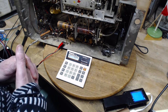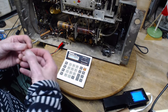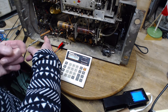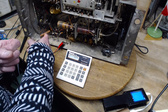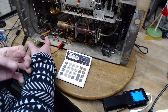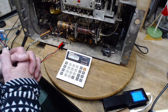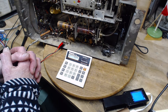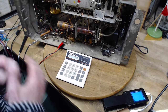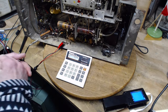Now, since the voltage over here never went down, it's always at 250, the field coil is feeling the same pressure, even with the resistor there. So putting this in isn't really cutting the current down in the field coil. It's just giving another pass so more current can get there. It doesn't feel right to me. Come on, you put something in parallel with something, more current goes. Well, maybe not, because the power supply is strong enough to stand up its voltage at 250.